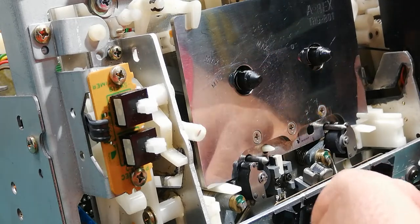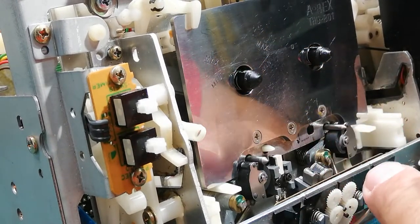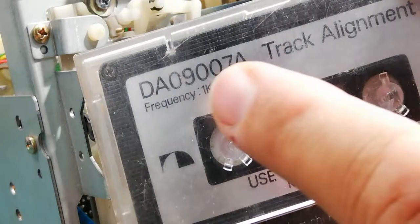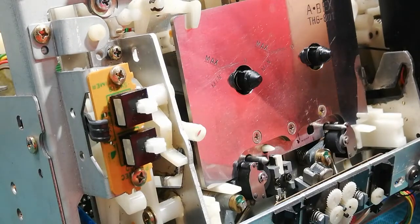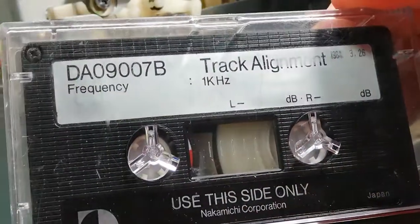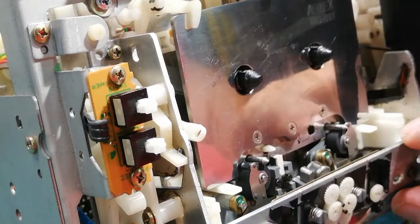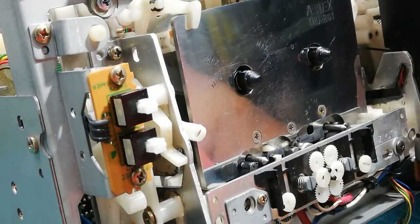The last thing after finishing this is to use a registration tape — one kilohertz. The best way is if you have an original Nakamichi track alignment tape: part number 9007A, or for newer — so-called sunken — mechanisms, it's 9007B. With this you can finally make a precise adjustment of the head height as well. That's it, thank you for watching.